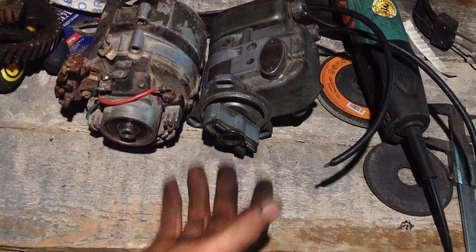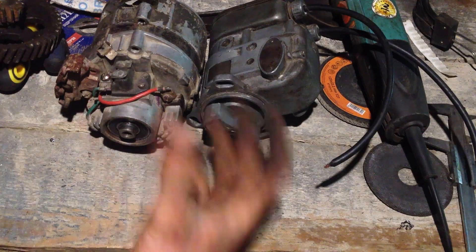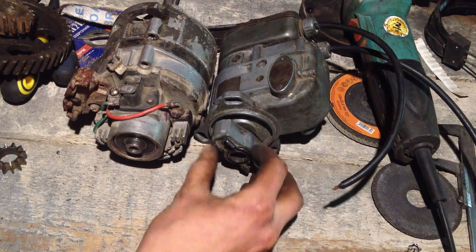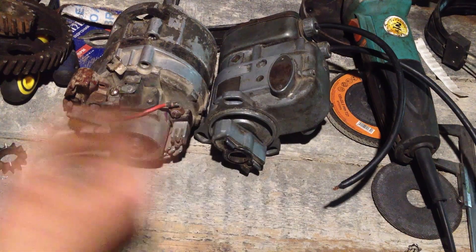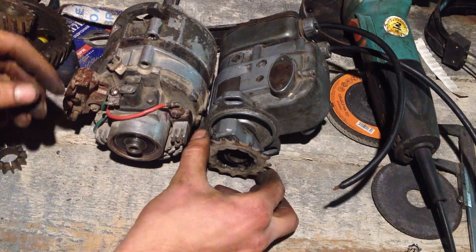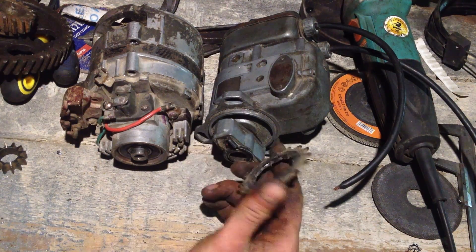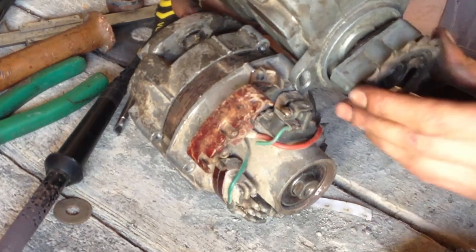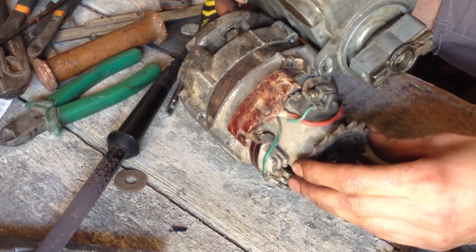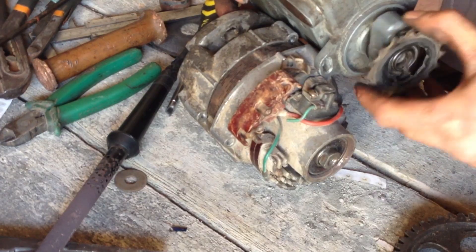These gears are 18-48, next ones are 15-40, these were 12-32, we can also put 9-24 gears here. But there's another combination: 6-16. What if I put chain sprockets here, like for a regular bicycle chain? I dug in my stash and found this sprocket with 16 teeth. If I put this sprocket here, put a 6-tooth sprocket here and stretch a bicycle chain in between them, everything should work. Yesterday I came up with a pretty good idea about the two sprockets and a bicycle chain. But again, I didn't take into account that the generator rotates counterclockwise and a magneto accordingly will also rotate counterclockwise.